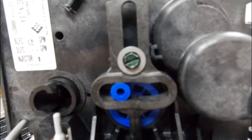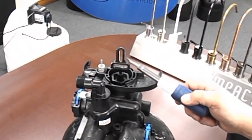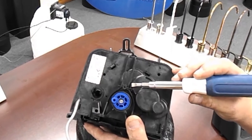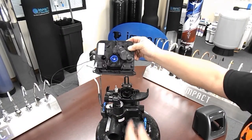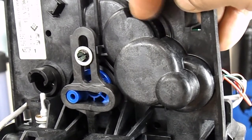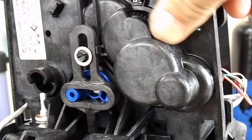Now comes the only complex part of the rebuild. The piston rod and the power head must align perfectly, or damage can occur during reassembly. As shown in the video, the piston rod has a thick and a thin side, and the timer assembly has a plastic stop to prevent you from installing the power head or piston rod incorrectly. Adjust the blue piston cam up or down so that it lines up with the piston rod by manually spinning the gear as shown. Be patient and take your time on this step — everything should go back together with ease and nothing should have to be forced.